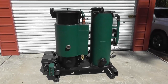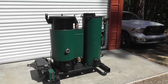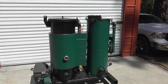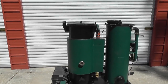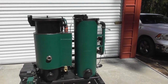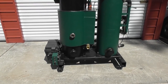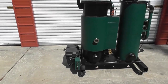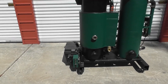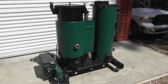I just want to show you all the sub-assemblies — this is what we're going to build. If we follow directions, you can build this gasifier. It's going to be a great production gasifier. We basically have two tanks. The tank on the left is the reactor tank with the heat exchange box attached to it. The tank on the right is the filter, and within there we've got a filter basket that holds all the filter media. On the bottom, we've got a base set up on good steel caster wheels. On the base, we have the switch box that controls the power for the blower and the power for the grate. You could add a glow plug ignition on that. We have a variable speed control on the blower. We've got an external battery box, which you can put a battery in, because everything is run on a 12-volt system.